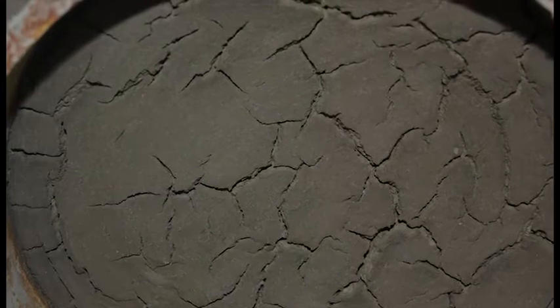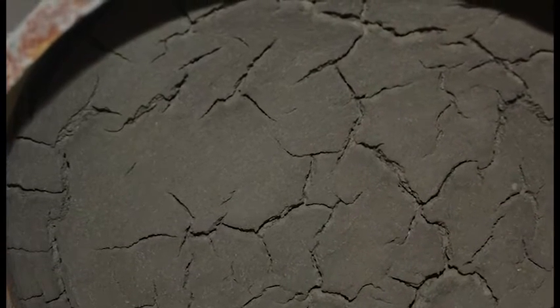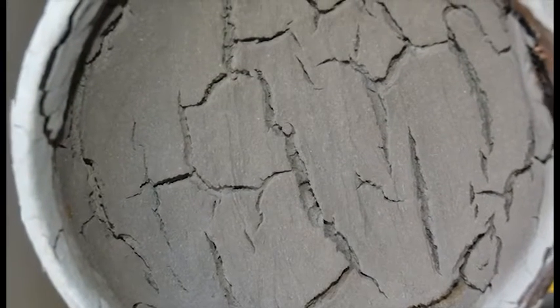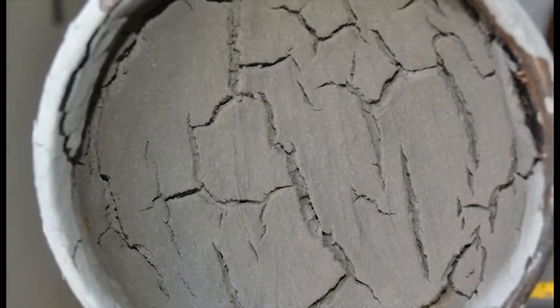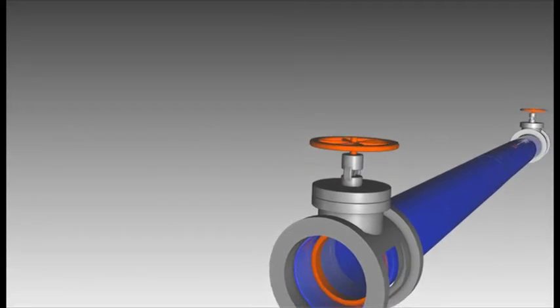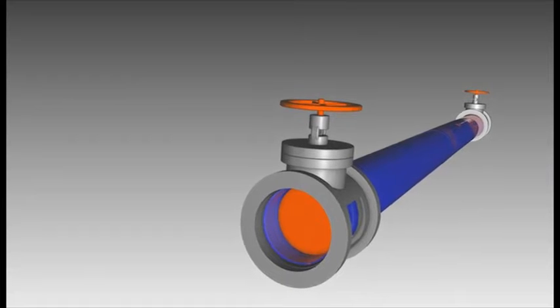After several hours, the surface of the plug may show some cracking and shrinking, but the interior of the plug should remain intact. Evaporation of moisture from the mud can reduce its effectiveness and elevated temperatures can make the problem worse. To isolate the repair area, upstream and downstream valves should be closed, locked, and tagged out at a minimum.